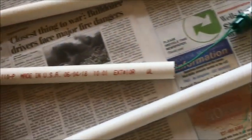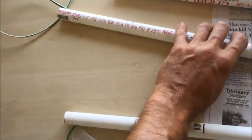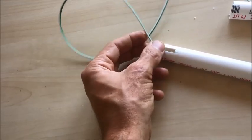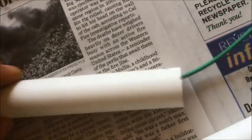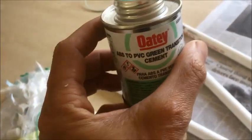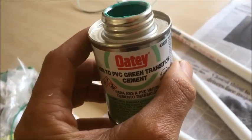We are building them — we just cut half-inch PVC pipe, cut a slot here for the cable to come out, and drilled a hole right here. Then we prime it with PVC primer and glue them. I just glued this with a gray PVC-to-ABS glue. These longer ones will be installed at 18 inches.